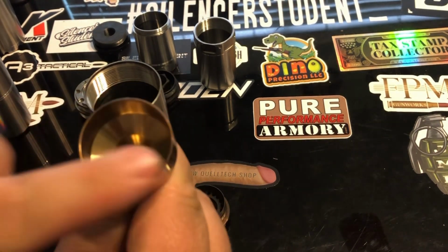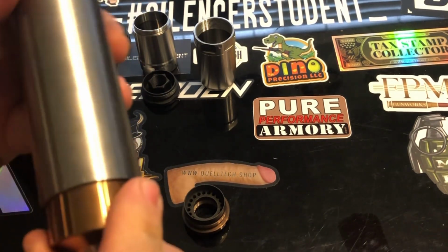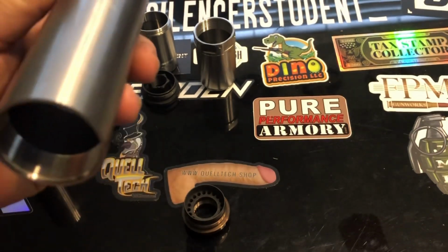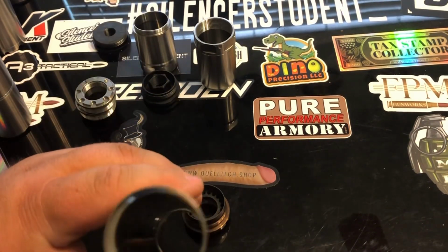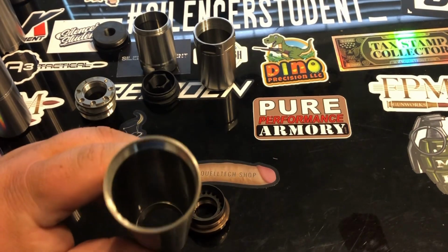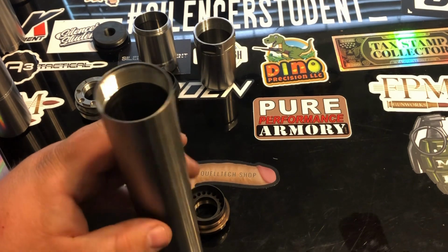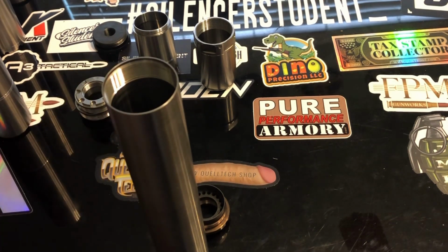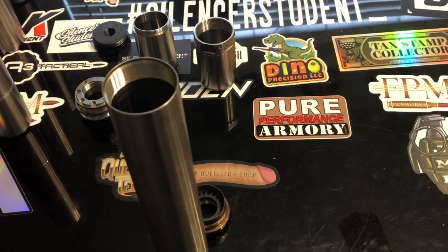1.355 inches wide and stick it through a hole that's only 1.313 like we measured earlier. So they're going to have to make one end larger. And that's where we get that 1360 or 1375 inner diameter tube, at least in the 1.5 stuff. So because they've made it larger, they might as well go with a size that is kind of already popular.